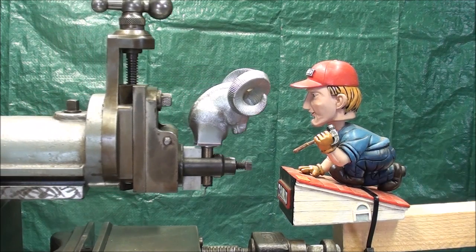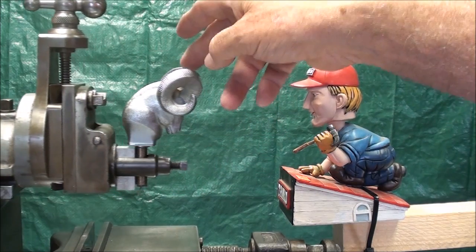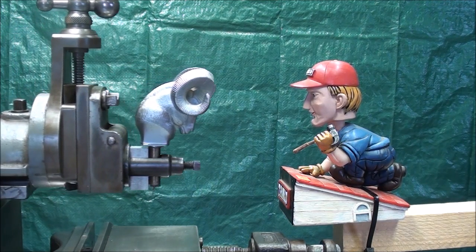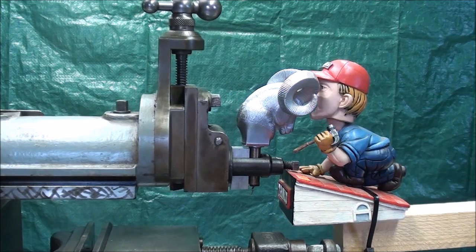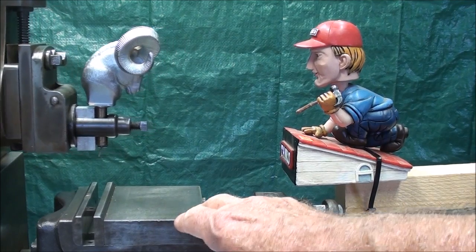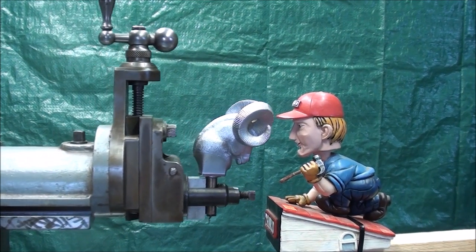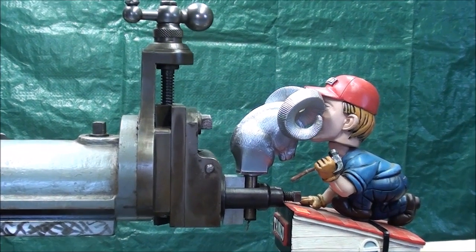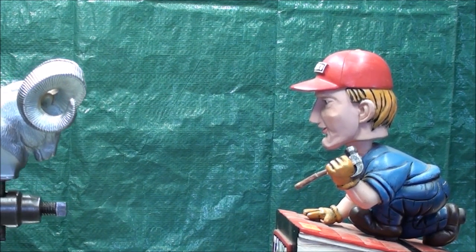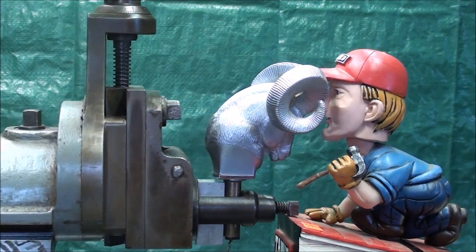Time for a little comic relief — and some of you are saying, yeah, very little relief. But this Dodge Ram, when mounted on the Shaper Ram, I guess you could call it the Ram Ram, but keep your head out of the way. When you set up a shaper, if you've got your head down close to the work and you're examining something, then you turn the shaper on, and with a faster stroke it's going to come and butt the heck out of you. So beware of that — that would be one of the most dangerous things concerning the metal shaper. Mr. Bobblehead here thinks that he can hit the Ram Ram, but he's not going to do it. Ouch!